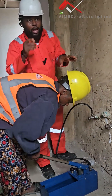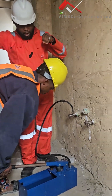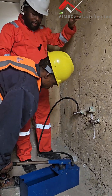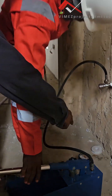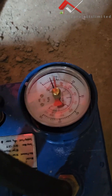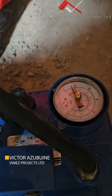So if there are any leakages anywhere, you will see visible soap on the walls. As they are pumping and applying pressure, we will keep on doing that until the water has traveled to all the connections — at which point it will be hard to pump further and you know it has stopped. The regulator will show the pressure level, and that is what you will see when you come back after 24 hours.